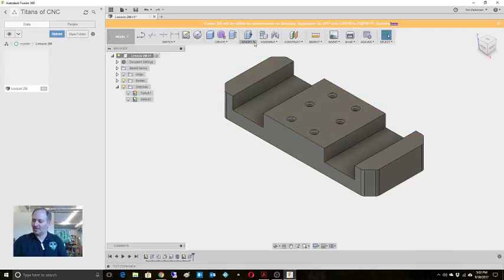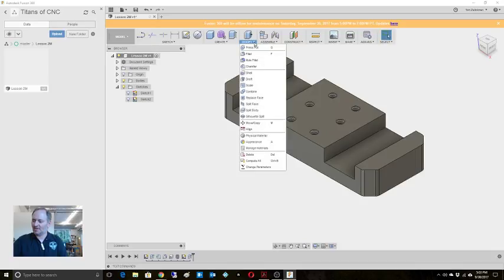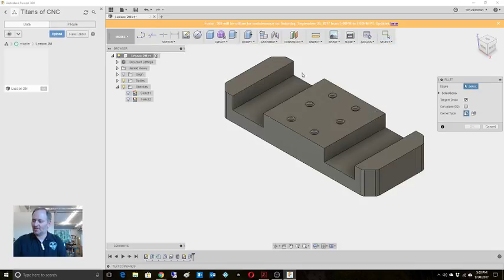Only thing left is doing a radius, doing the radii fillet. This edge, this edge, this edge. Hover over, you got the edge there, this edge, do the same thing here. There's our 8 edges, and it's supposed to get a 0.02. That's it.